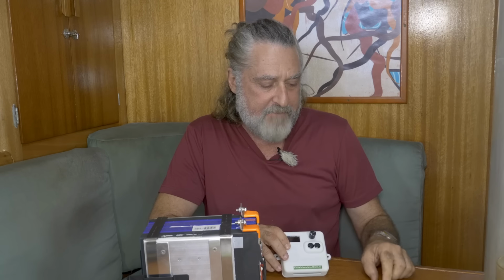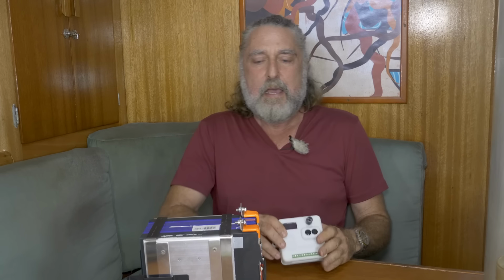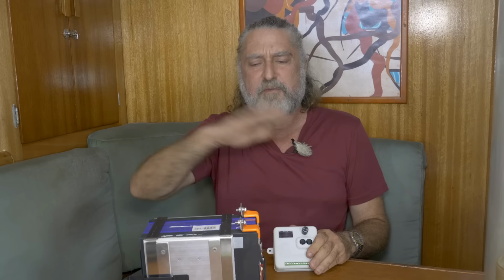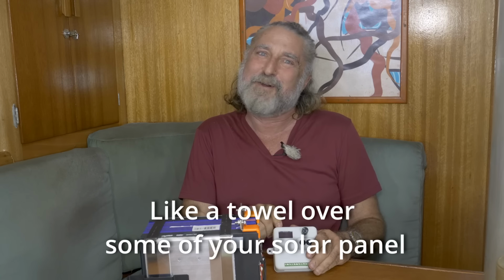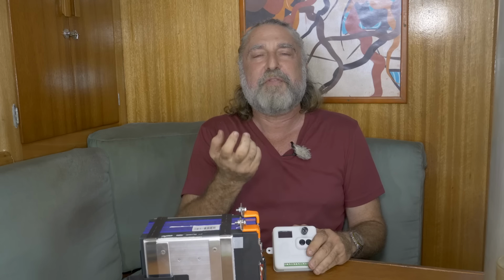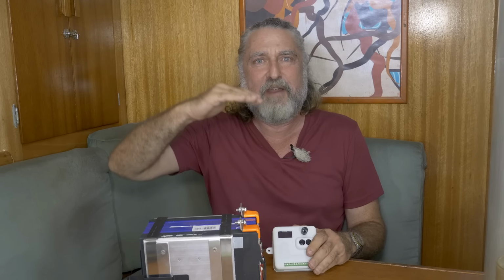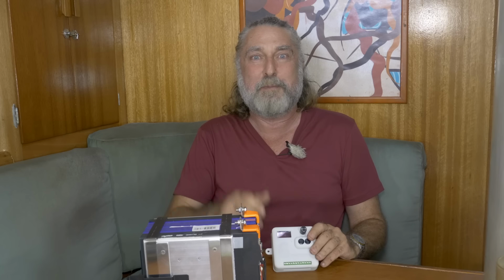Now, if you're using a balancer that you don't want to push too hard, when you do that special equalization charge, just slow down the charge. Do whatever you have to do to the rest of your system so it's not putting out. This is not the day to run your alternator at 170 amps. This is where you want to charge it like 2-3 amps. Let the voltage come up very slowly. Then this guy will have a fine time keeping everything equalized. And at the end of that cycle, you're probably good. Anyway, just wanted to throw those thoughts in.